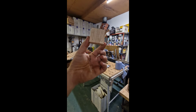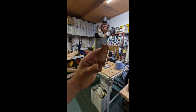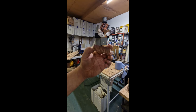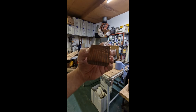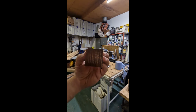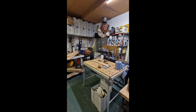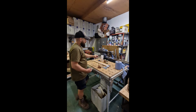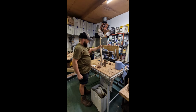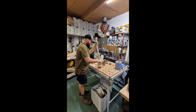So that's ash in its natural form, English white rippled ash, and I've put Creative Buffalo Brown by Odie's Oil, the pigment, in their Super Duper Dark oil to mix it, and look at that. That, I think, is what the customer wanted. Absolutely spot on. So, always good to do a tester. That's what I've done. I'm happy with that. Now I'm going to put it straight on the axe handle, and you can decide whether it looks as good as what I think it does.